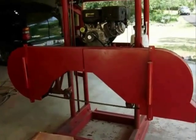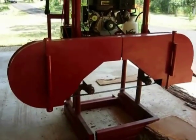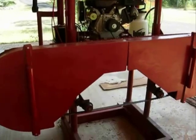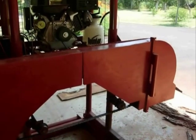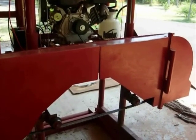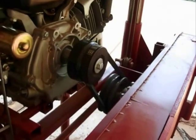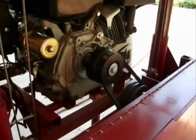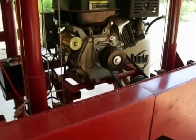For the saw itself, I have wood covers for the blade. I did that because if a blade ever breaks, the thought being that maybe the blade will hit wood and might be salvageable. It uses B belts on the pulleys. On the drive side I have the big 20-inch pulley and a smaller pulley that runs off of it, sharing the B belt with the blade. That goes through and is hooked to a clutch — as you rev up the engine the clutch engages, giving me a real good drive system. I don't have to fool with engagement and disengagement; I just lower the engine speed and everything works well.